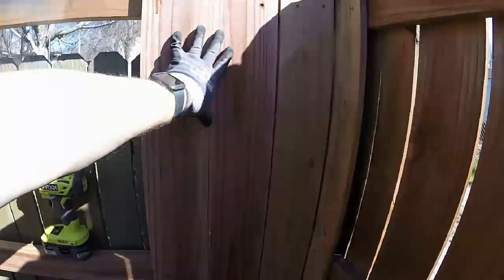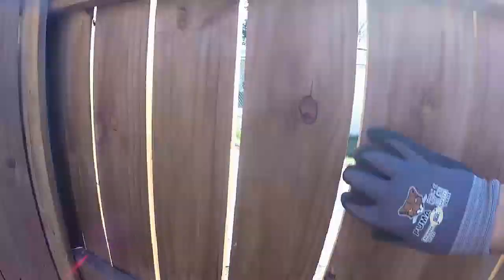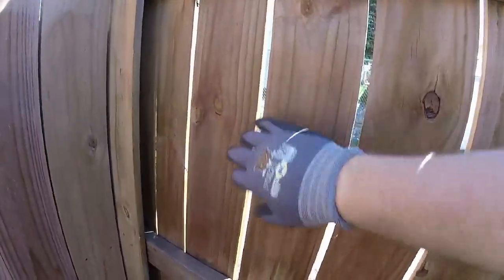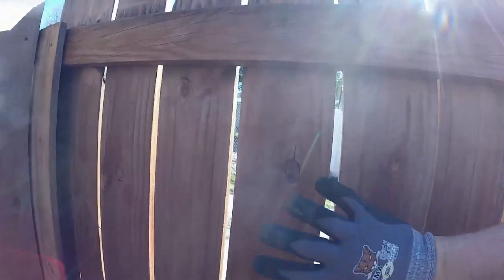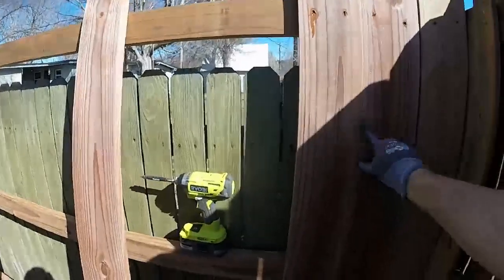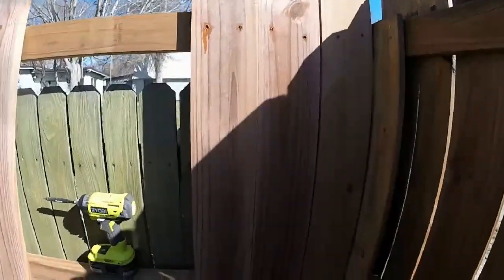And I'm doing this with these wet planks because as they dry out, as you can see, they will develop their own spacing. Some get to be quite a bit wider than others. Some of them tend to be tight, and still provides you your privacy. And if you do get into winds, it still allows an airflow to go through. Being tight like this, normally you wouldn't have it, but because these are so wet, they're going to shrink